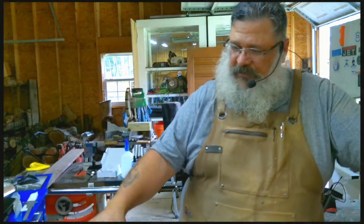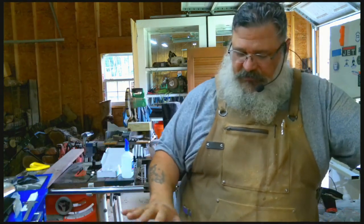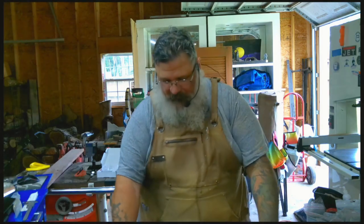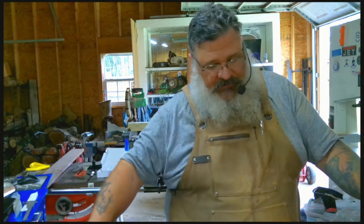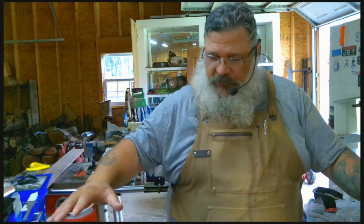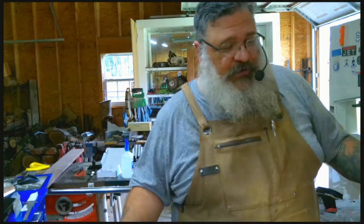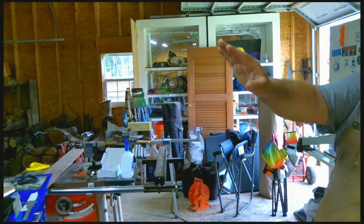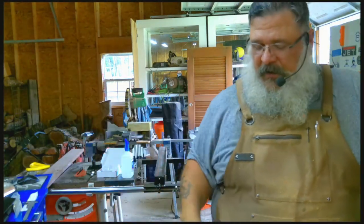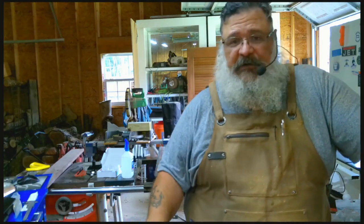Here we have a very heavy column with the motor and the headstock, and then a very light tailstock end. So this lathe is light on the right end, and I think I can address that. There's a shelf down below, and if I put a couple of sandbags on the far end, I think that will counteract the tendency for it to want to lean towards where the weight is. It's exaggerating, but I feel like I could just put my hands here and lean back and lift that tailstock up in the air. That is an exaggeration, but I think it's easily countered.